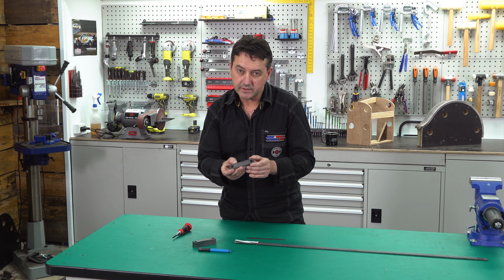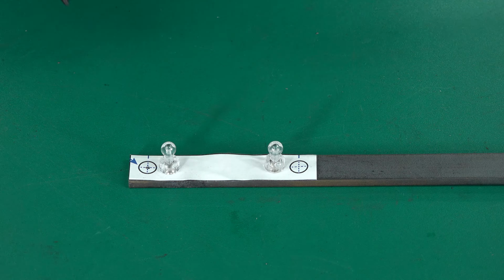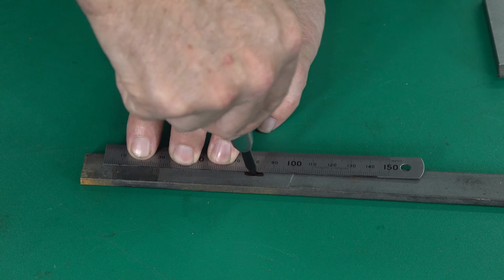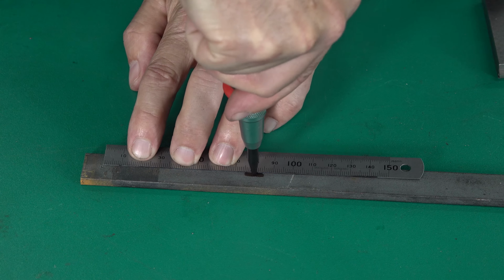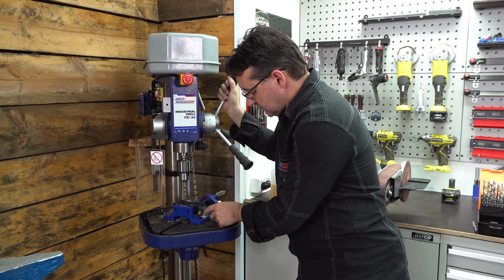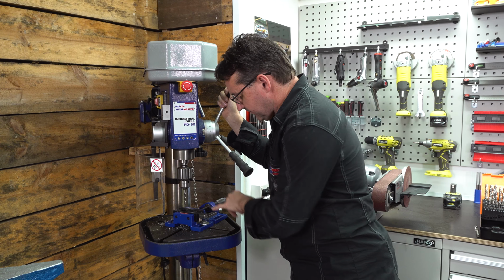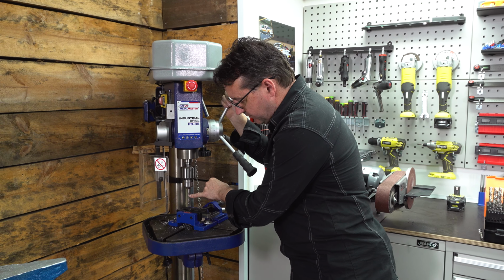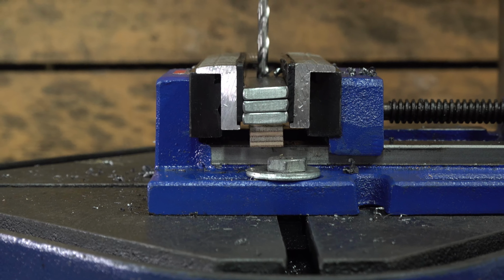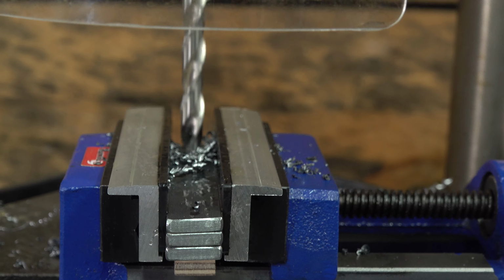This is one that we've laser cut out previously, so we'll do it by hand now. Again, this is a template that we've cut out from our drawing, or you can measure and mark 80mm to your hole centre, and we're going to make 6 of them. To save time, we've stacked 3, so that way we'll do 2 batches of 3. Our hole centre, we're doing a 5 or 6mm hole through as a pilot, and we've got timber underneath so that we can drill through into the timber. Then we'll go through with a 10mm drill.